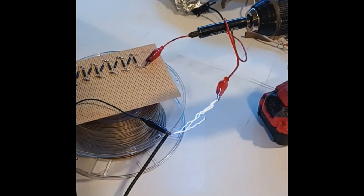So anytime you get one of these transformers, you're going to have to rectify to DC, then back to AC to get a true AC out of it. Or you can rectify just as a DC and get a DC signal out of it. Either way, you're going to have to rectify it. This right here that comes out of the flyback transformer is a different energy altogether.